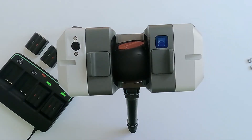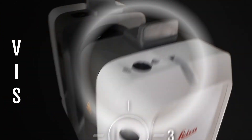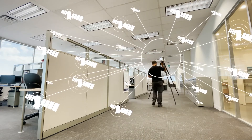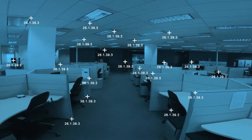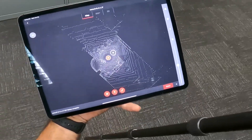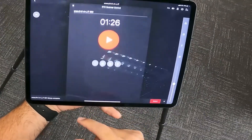However, the real magic is when it comes to these five eyes. Technically they are called VIS cameras, which stands for visual inertial system. This computer vision technology can be compared to having thousands of satellites to position the scanner as it's moving from one setup location to another, except that instead of satellites it is tracking objects in the surroundings. Because the scanner positions itself automatically, the time it takes to do registration work in the office is drastically lower — you can complete your in-office registrations in a fraction of the time it would have taken you before.